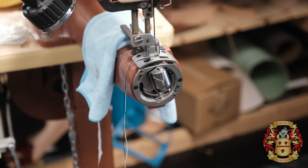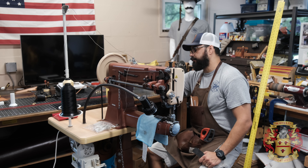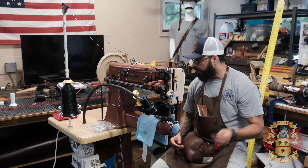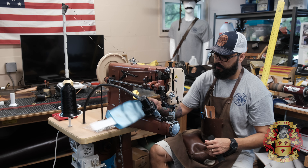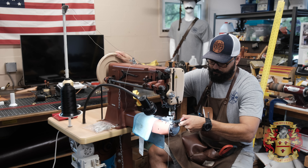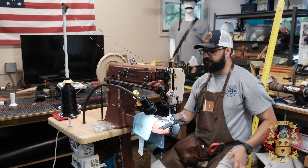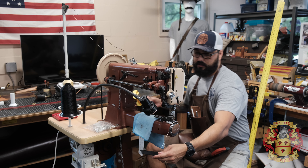Now I'm going to do a little test run and then we'll finish stitching that radio strap. You want to make sure there's nothing hung up or caught on the belt — this rag sometimes likes to sneak over. Also make sure nothing's caught on the pulley down here, no other thread or anything like that. Make sure these are ready to go, not tangled up. I always do a scrap piece first. This will soak up any kind of oil that's just lingering there. Make sure this is under the foot and do a little sample piece just to make sure we are good to go and the machine is behaving well. It sounds right — a lot of this goes by sound. Nothing sounds off right now. You know what I'm talking about when you've been running a machine for a while and something just doesn't sound right — that's a telltale that something's wrong. And now we're ready to sew.